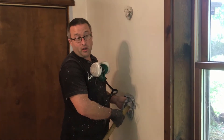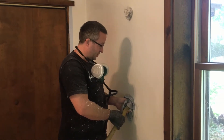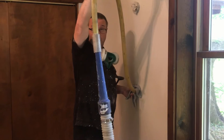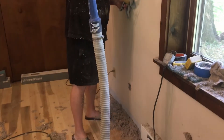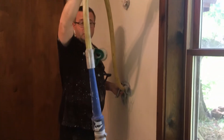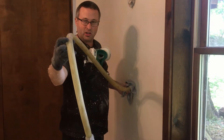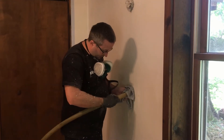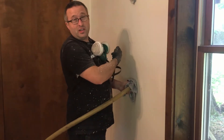I'm in my soon-to-be office insulating the walls, and I'm doing what's called a dense pack. A dense pack uses a tube like this — stepped down from a three-inch hose at the machine to a one-inch inside diameter. This hose is presently about six feet into this wall.